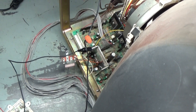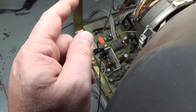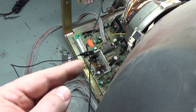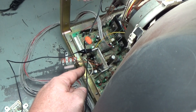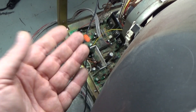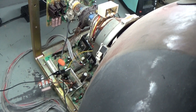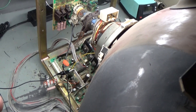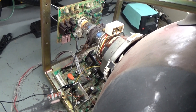I may have to remove that and do some testing. If I find something that is the smoking gun, I'll report back. If not, when I come back you'll see that all of the reflow, rework, and flyback replacement on the neckboard have been done. With the 30-volt reference present, I'm suspecting the flyback is bad, but it could also be a counterfeit vertical IC. If I find that's the issue, I'll show it. Let me cut away — I'm always long-winded, and in the military I was used to explaining things a thousand times to people, so that's still with me.